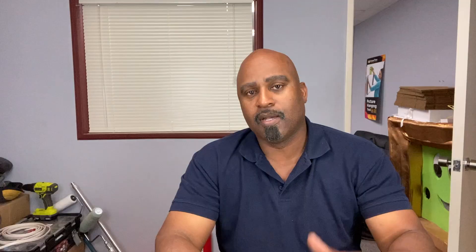Here's a quick safety tip: hold both leads in one hand when doing the testing. Put the black in the neutral and the red in the hot with one hand — that decreases the risk of electricity running through your body if you happen to get shocked. If you learned something from this video, hit the like and subscribe button. Don't forget to go to calibrate.com, check out our products, and join the email list. See you next time.